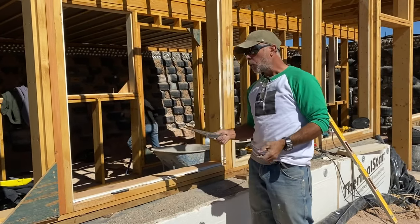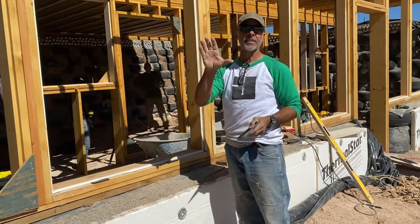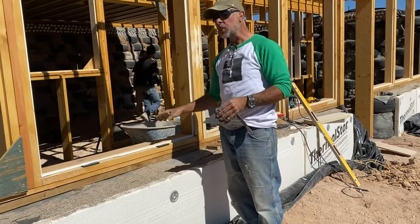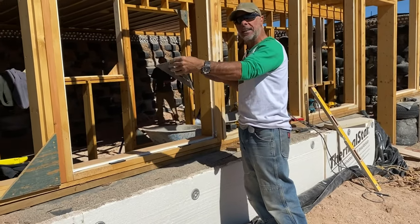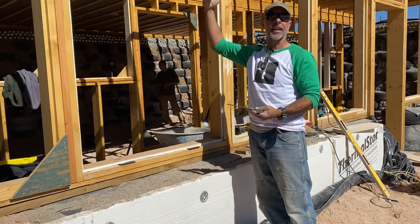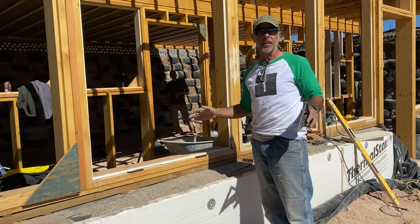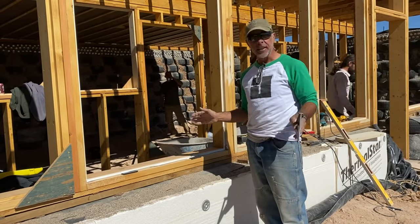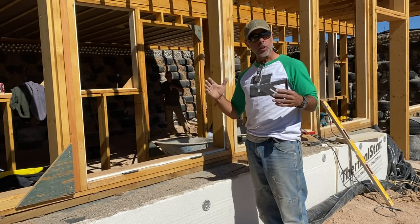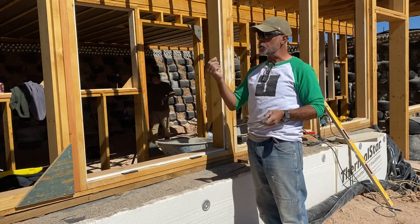All right, now, when I built this, I designed it to fit glass that's 46 by 76. This is 46 and a half, or a little less, 46 and 7/16, by 76 and a half. The reason for that is glass has no flexibility. When this glass goes in, it's in for good. So we want to make sure that this frame has some expansion and contraction ability. So that's the reason for the extra space around it.